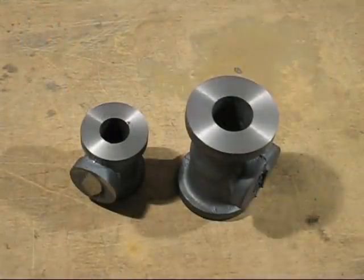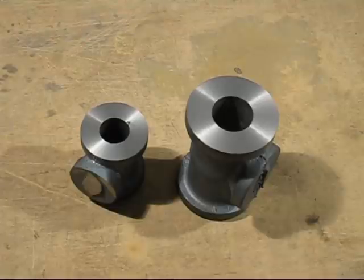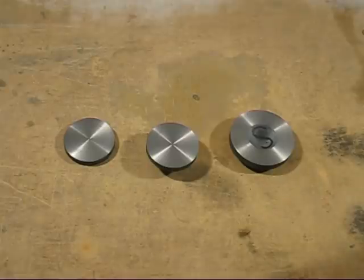All the castings have been machined to check for chill. With these two cylinders, they have the same result as last time — absolutely perfect with no chill. I like to cast a wide variety of shapes and sizes to identify problem areas. I have identified one: the smaller the casting gets with disc brake rotors, the more problems you'll have with chills. So you need a very good wedge test. These are the smallest three castings I poured this time, and they all have a degree of chilling — but far less than last time.